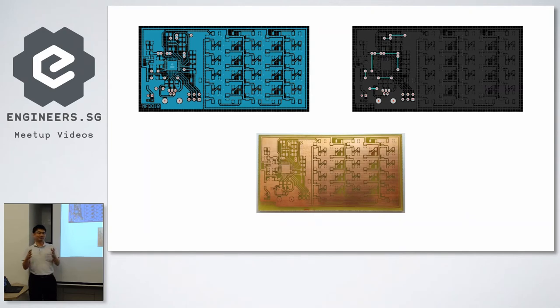And we know that, for example, a through hole resistor has two pins, and the two pins have like an 11 or 12 millimeter gap, and you can run multiple traces in between. However, if you are using an SMD part, then you will no longer be able to run any wire in between two pins. So when you design this kind of board, suddenly you feel like you are missing one dimension.